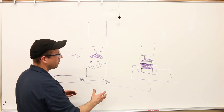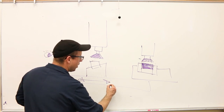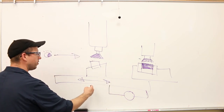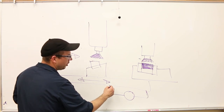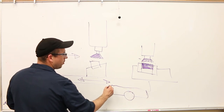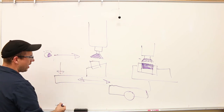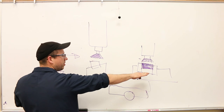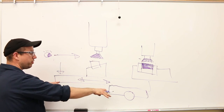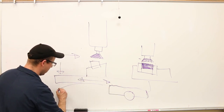Now, sometimes people get a little bit lazy and they'll move the table over and put the tramming plate right here, okay? And then the actual knee is over here, right? And all of this section of the table is hanging off to the left. Well, the problem with that is that there's a little bit of clearance between the table and the knee here, or the carriage, rather. This is called the carriage. So there's a little bit of clearance there. And so if you slide everything all the way over to one side, the table is going to sag a little bit over here, which is going to throw the angle off on the entire table. Also, even though this is made out of cast iron, it's still susceptible to a little bit of flexing just under its own weight. So again, instead of just cocking out at a nice angle, this thing is going to sag like that. So it's actually going to bow.